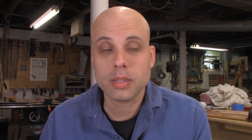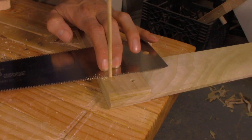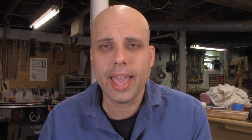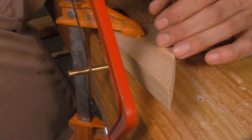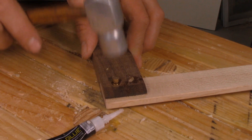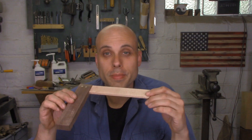While the glue on these is drying, I'm going to do some trimming and detail work on the larger square. I'd like all of these squares to have a couple of pins through the bridle joint for extra stability. For my big poplar square, I'm just going to use some bamboo chopsticks — bamboo is a really dimensionally stable and ultra-strong material and I got it for free from the Korean barbecue place down the street. For the more fancy squares, I'm going to go with some brass rod. If you've never worked with brass before, it is super easy to cut — all you need is a cheap hacksaw and then maybe a file or some sandpaper to smooth things out.